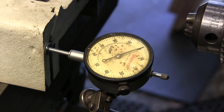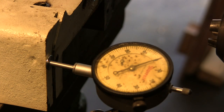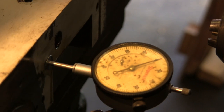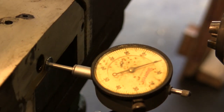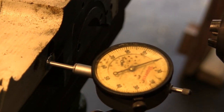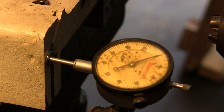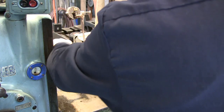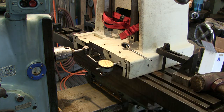We're going to snug this clamp down here. All right, we went ahead and locked our carriage in and out, and we can find that our adjustment is satisfied with it making it all the way across here, and all the way back and maintaining our zero. Okay, we've swiveled it and we've locked it down and we're able to come and sweep zero zero both sides.